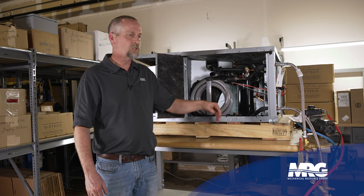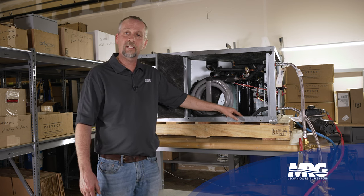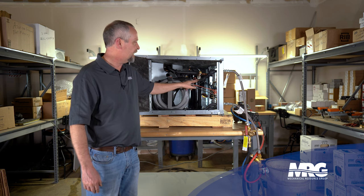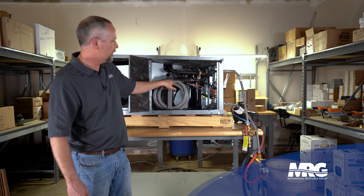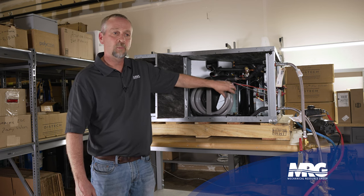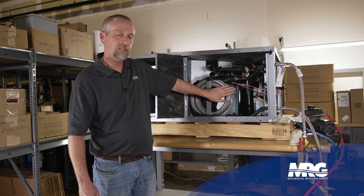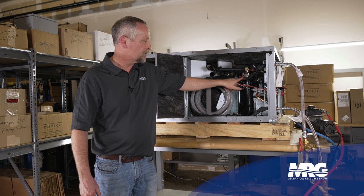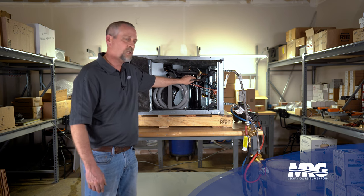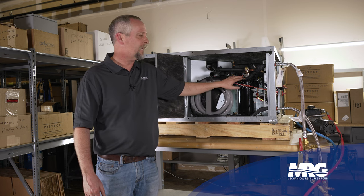What can happen sometimes is you may get a dirty strainer, or maybe the strainer's clean and you've cleaned it but you're still having issues. What can happen is you can get some trash stuck in this copper piping as it goes through the loops and back out — comes in the bottom, circulates through. As it does that, it's rejecting or absorbing heat from the refrigerant that is in between this steel jacket and this copper piping. Inside the copper piping is water; outside of the copper piping, encapsulating that in this steel jacket, is refrigerant. We're going to talk about how to get that trash out of there.